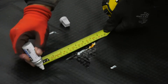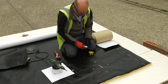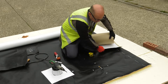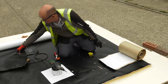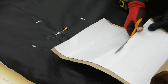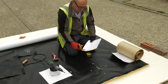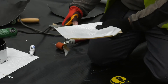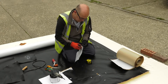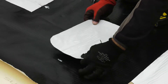To form the repair, there are a couple of options: we could use a self-adhesive membrane, or we could heat weld a patch. In this instance, we use a 300mm self-adhesive membrane. Using scissors, cut a suitable section of membrane, round off the corners, activate the bitumen with heat, and apply the patch, rolling it firmly into place.